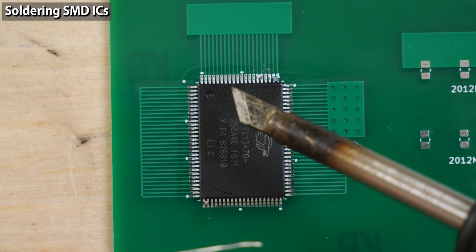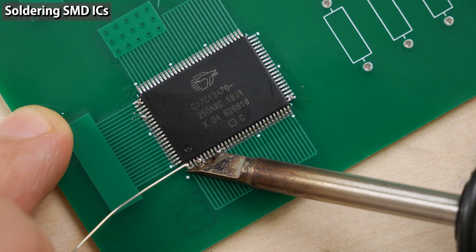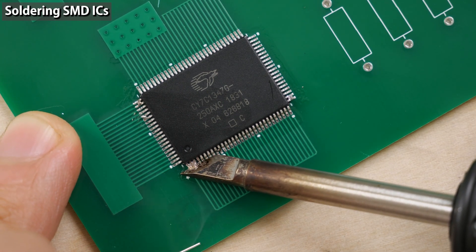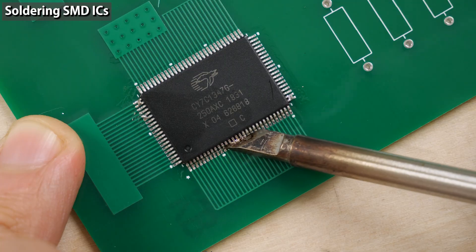Now let's have a look at how to use the K-type tip. When using a K-type tip, you have to turn the tip so the blade is parallel to the PCB to transmit the heat well. If you do that, you can solder quite neatly. I wonder whether it's better to have the sharp edge in front or the edge with the larger angle in front.